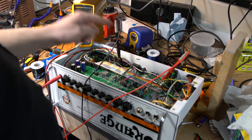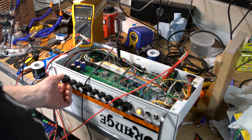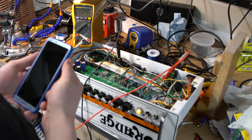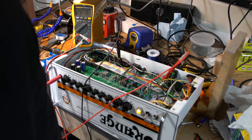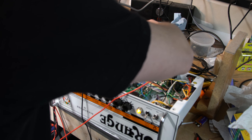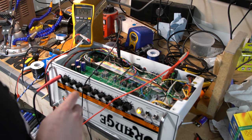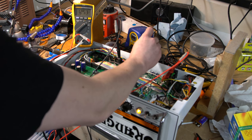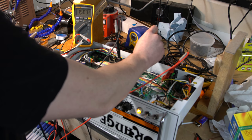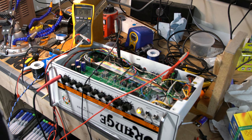Alright, we're back — re-tubed, hooked up to the yellow wire, and powering back on. All volumes are down and we're going to check the bias now. That's a lot hotter with these tubes — probably because these tubes can conduct better since they're in better shape. I've got to dial that down quick. The tubes were up to two volts, which tells me the new tubes are just conducting better at the same bias setting — another sign the old tubes were worn out.